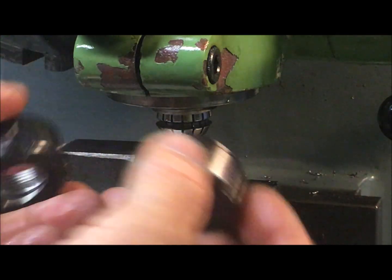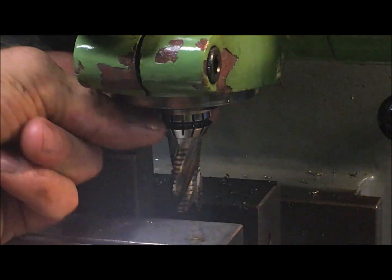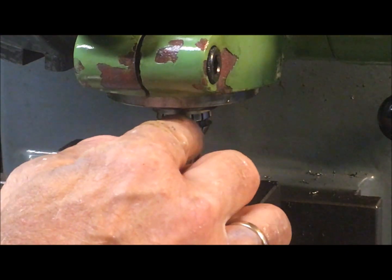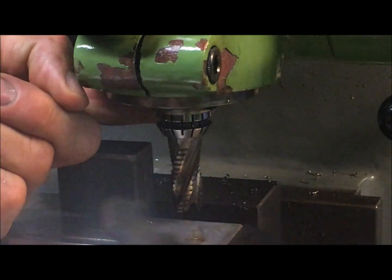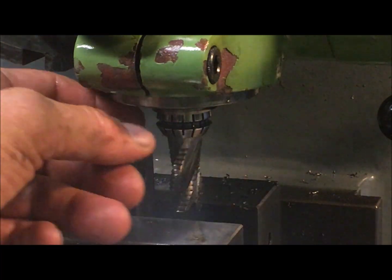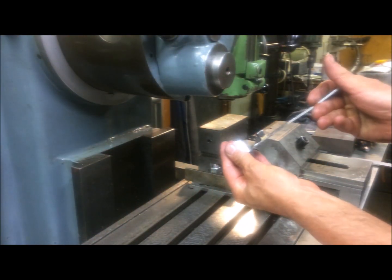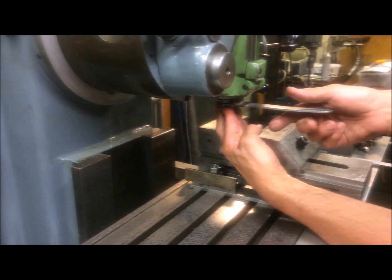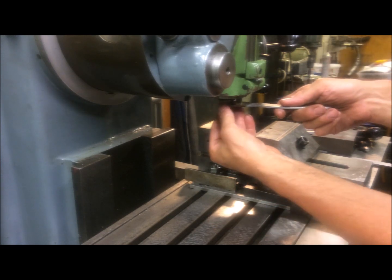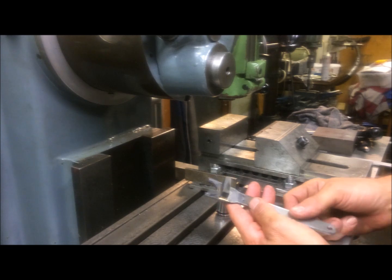So either I make myself a new nut, or I make some sort of extraction tool — for instance, a clamp, like two jaws that clamp into the circular groove here, maybe a pivot point on the other side — it should be possible to do it that way. I made an extraction tool for the ER holder. If it's stuck up here, I can pop it out like that. I thought that was the closest I got to smartness instead of banging on the collet itself with a rubber mallet.